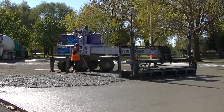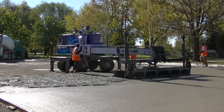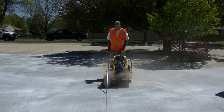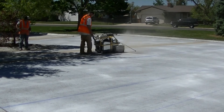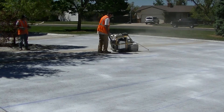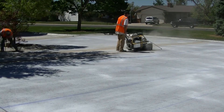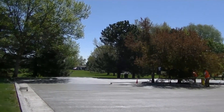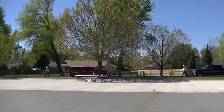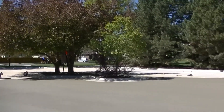Concrete resurfacing is a very cost-effective way to upgrade your parking lot. This three-inch concrete overlay is not really a new technology. The key to making it work is closely spaced joints — that greatly reduces the stresses that build up in the concrete pavement. By spacing the joints at four-foot centers, we create a pavement with very low stress and we're able to build it at a three-inch overlay. If you have a facility in mind, please give NRMCA a call. Go to our website, nrmca.org. We are here to support you and your projects.